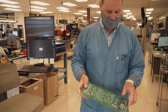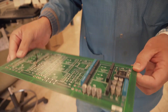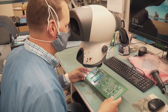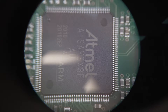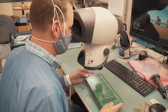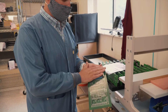After it comes out of the selective solder machine, all these through-hole parts are soldered into place and you have beautiful shiny solder joints on the bottom, all done automatically. Now we're going to inspect the board to make sure all the parts and solder joints are looking good, check anything the AOI may have reported, and check everything else the AOI couldn't see — there are certain parts it can't see. Now we have to depanelize this because it's in a panel with three boards, and even though we're not building these two, we still have to separate the one from the other two.